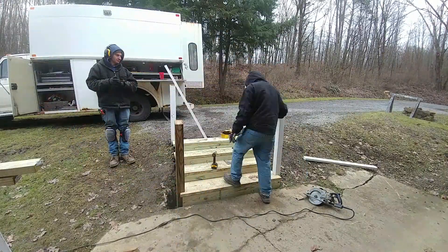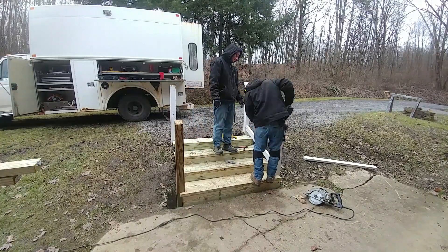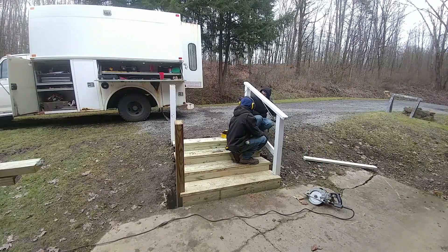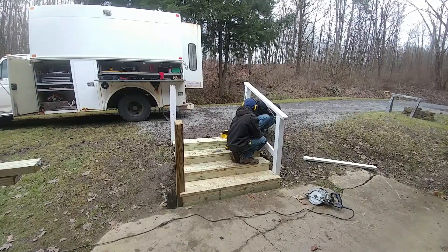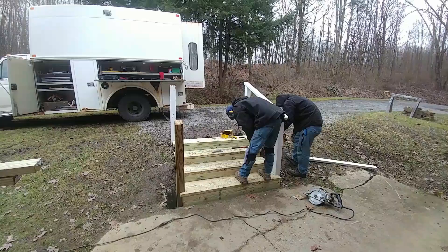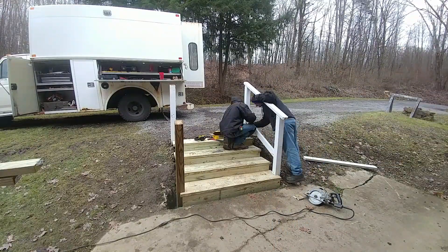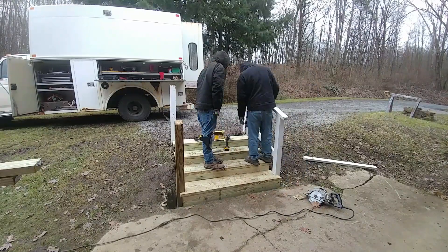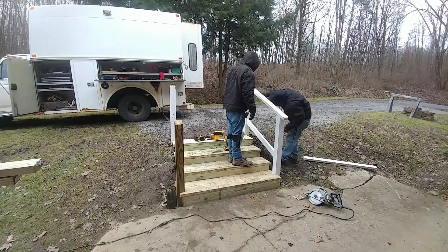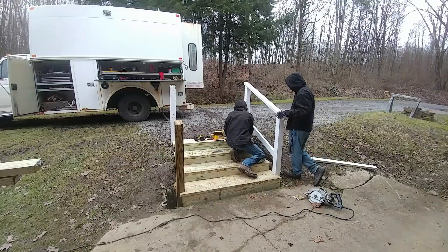You know, if it's an inch off, that's good enough — or six inches off, yep, that's good too. My dad said when he bought this place, these steps were here and the old ones were at least 40 years old, which really surprised me. So in 40 years, the concrete steps had sunk, and that's kind of why we didn't want to put concrete steps back in — we'd just have the same problem again eventually. With wooden steps, they're a lot lighter and putting a lot less pressure on the ground.